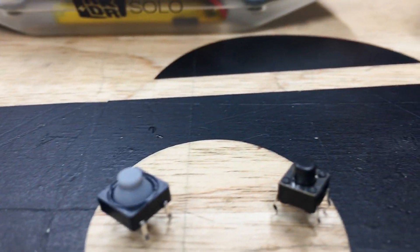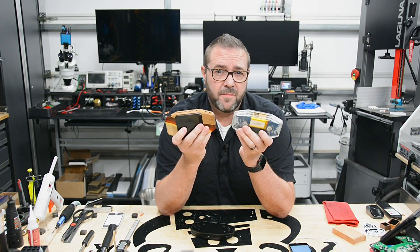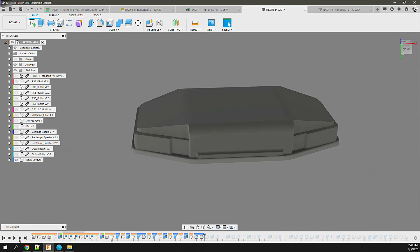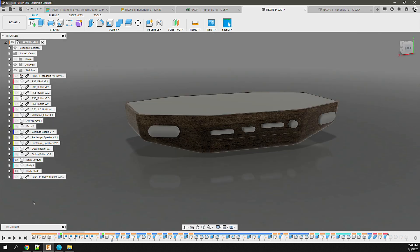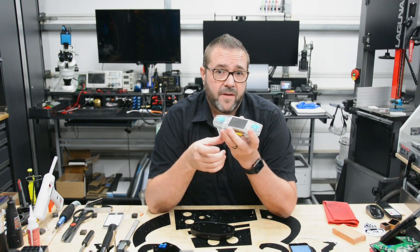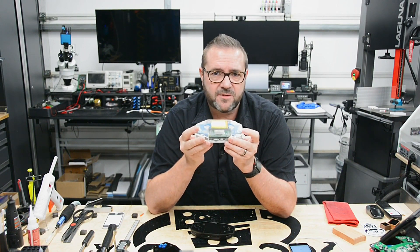To try something different, I made two prototypes: one with my traditional soft silicone buttons and one with classic clicky tactile buttons, just to see how they feel during gameplay. Design-wise, although it shares similarities with the Arcader 2, a lot of work went into this one — the enclosure and inner components were redesigned over the course of 200 revisions. Because of the complexity and inner tolerances, I chose to model the negative space in the cavity — basically the space occupied by all the parts when in the correct positions. This was then used as a tool to intersect with the body, hollowing out the negative space. Cross-section analysis then allowed me to evaluate the body wall thickness and adjust accordingly.